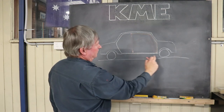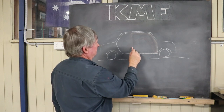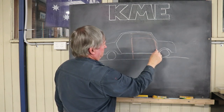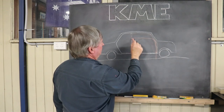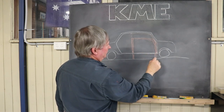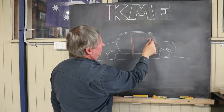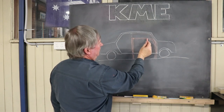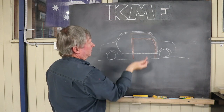What I do is I'll drill a hole through the floor pan of the car, drop the roll cage down, and then while the roll cage is down through the floor - not a very good drawing - I can weld over the top here, finish anything I didn't do there, and the cross that's in the top I can weld any section of that while it's down here. Once you've finished that, the whole lot goes back up again.